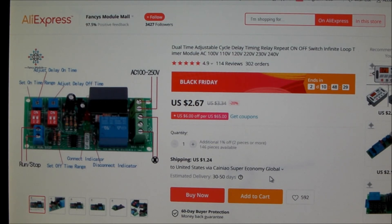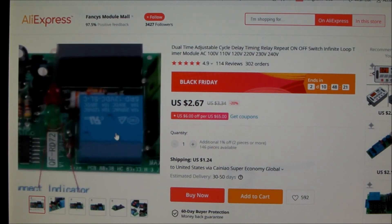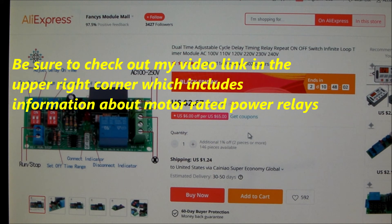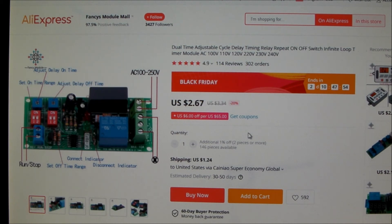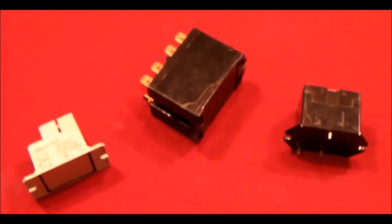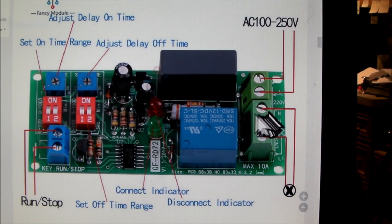I also want to add a power relay — I'm going to have this timer drive a power relay only because I don't fully trust the onboard relays to handle a motor. You can buy power relays on eBay for generally three to five bucks. Just make sure you buy one with a 115 to 120 volt AC coil that is rated for motor use, so it will have a motor horsepower rating on it. Don't concentrate so much on the amp rating — a 10 or 15 amp relay may be sufficient, but make sure it has a horsepower rating, typically half or one horsepower. One horsepower power relays are quite common.